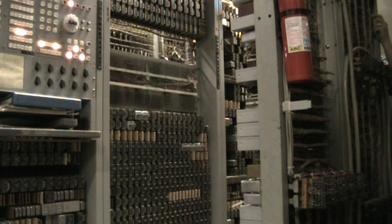The number 3, because it was a small office, they had 2 markers so they could do either function. Normally, marker 0, for example, when a customer went off hook, would set up a call to give dial tone out of an originating register, and then marker 1 would complete the call when the customer was finished dialing. Of course, either marker can, like I said, either set up a call or complete a call. And if one is made busy, then of course it does both functions.